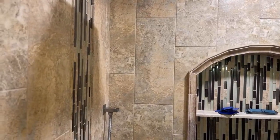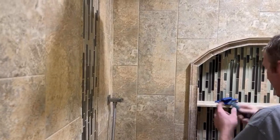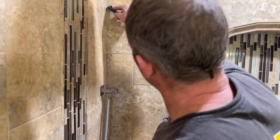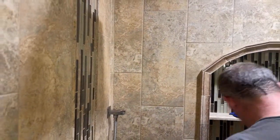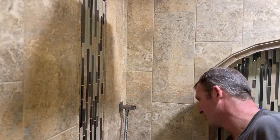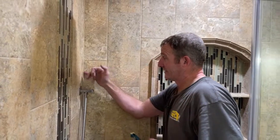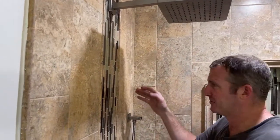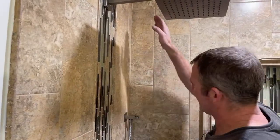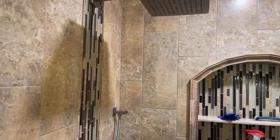The next step is to use some Windex. This Windex is going to keep it from smearing onto the wall, so you always just spray that area. I'm going to try my normal tool that I like to use. Just put a lot of pressure on there, and then a lot of times I have to go back over with my finger to tool it. That's not too bad. Really, as long as your corner joint is all free of thinset and it's actually a full gap, the silicone going into the tile work is what's really going to hold that silicone in place and make it last a long time. If you have your tile completely tight to the wall, all you're doing is smearing silicone on either side, and it's not going to last as long. If you can get silicone to go into that joint, the better it is.